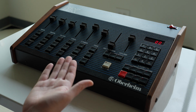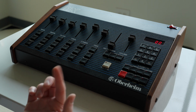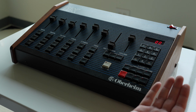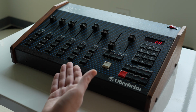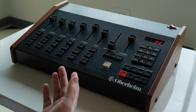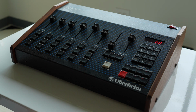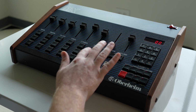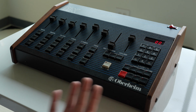You can either go in and disassemble and take the buttons apart. There are these springs and these wires that will corrode over time. I think this is from like 1982, '83, '84, kind of in that range. So it's been around a while, and it's had plenty of time to start to develop some corrosion. And that's exactly what's happening. Sometimes they'll get so corroded that you can't even trigger a sound. And there are other times where it'll do exactly what this is doing and multi-trigger. So that's method number one. You just go in and fix it, and then there you go, no more problem.